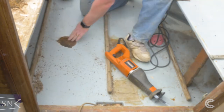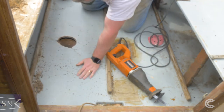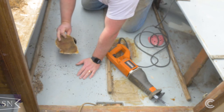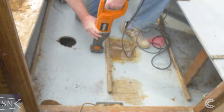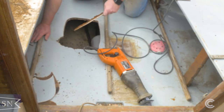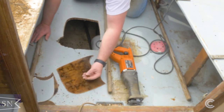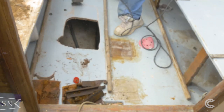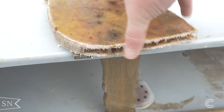Since I didn't know what was under there as far as supports, I didn't want to take too much out until I understood what was going on underneath. So I just took out a small piece at first just to get a look. There was just a top layer of fiberglass, an underlying piece of fiberglass, and the core was gone. I took out this first piece and could feel that it's still completely wet even though there hasn't been any rainfall or water on this cockpit in months. Getting a brief look underneath, I could see two supports — one near the front and one near the back. As I went out from the center of the cockpit I could see more and more evidence of rotted core. In some places I found remnants of a wood core that was nothing but sponge; other places were just completely gone with nothing but a void between two pieces of fiberglass.